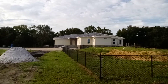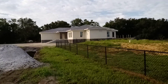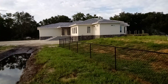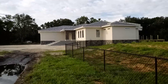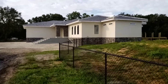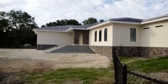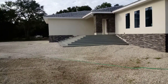This is the house we're powering. The reason he's doing this is it's kind of his dream to have a house that can run off of solar. He's connected to Glades Electric Company and they've got a pretty bad net metering agreement — they give you three cents a kilowatt hour for whatever you send them. So if you produce anything over what you consume you get three cents, but if you consume anything they charge you about thirteen cents a kilowatt hour.